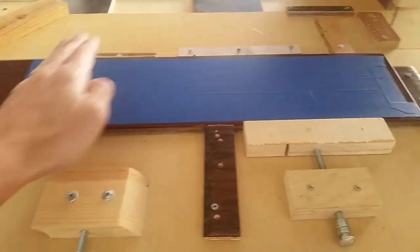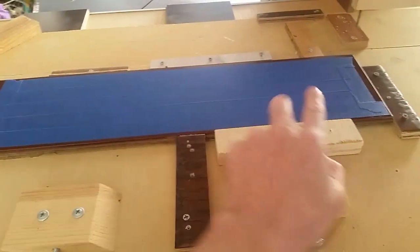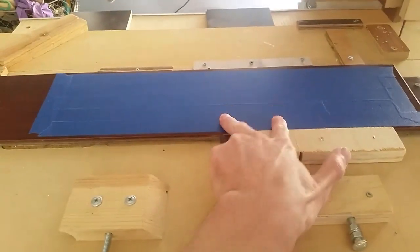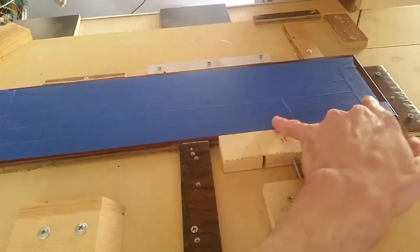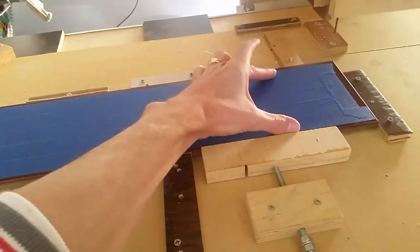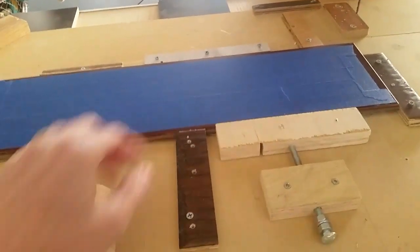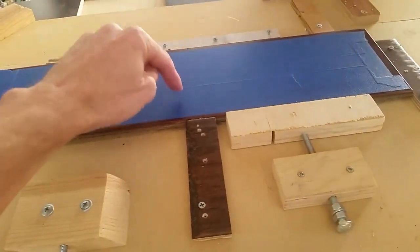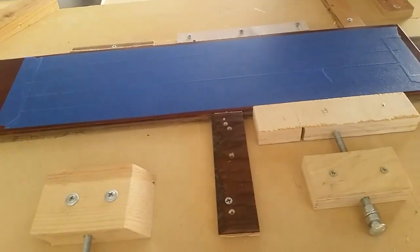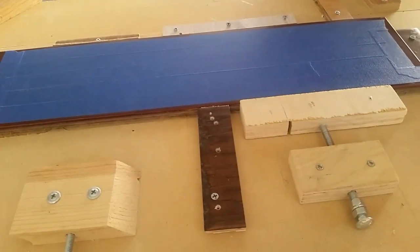There's a little bit of a bow in this wood, so I'm going to cut each coaster blank separately and then do the engraving afterwards with each blank positioned in the same spot. Engraving on a bowed piece of wood is really hard because if your bit goes down too deep with a V-bit, it just widens the hole and looks awful.